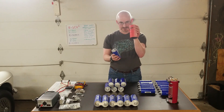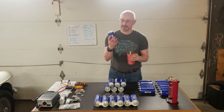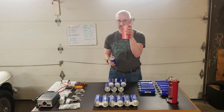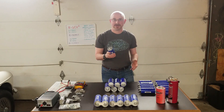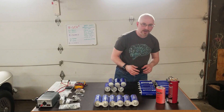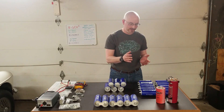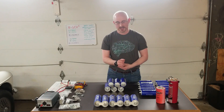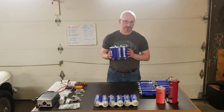The standard capacitor is rated for 12 to 16 volts, while this one is rated for just 2.7 volts. So I can't use it by itself — it needs some friends. Six total, wired in a series configuration. When you wire capacitors in series, capacitance adds similarly to how resistance adds in parallel, leaving you with 500 Farads for a bank capable of 14 to 16 volts.